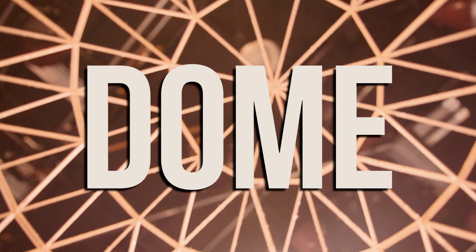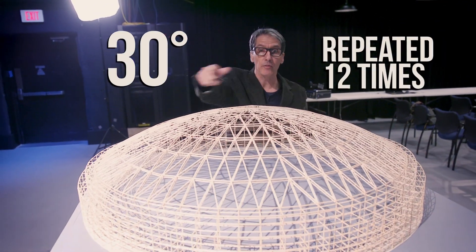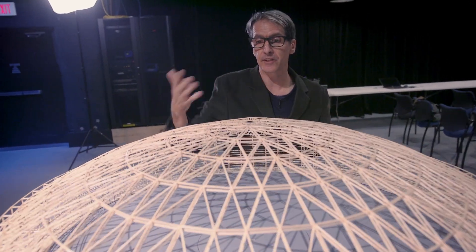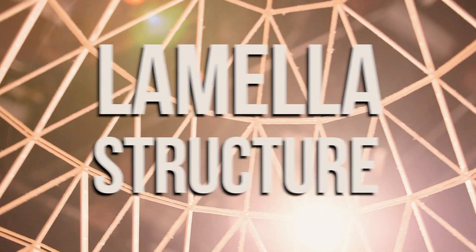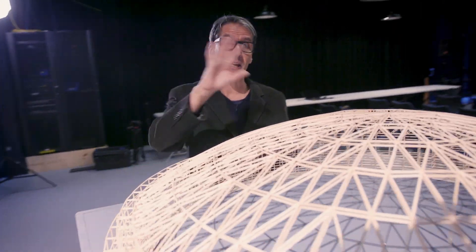The dome structure is very different — that's the second aspect. It's composed of this 30-degree segment repeated 12 times around the center of the dome, made up of triangles. It's actually called the lamella structure. Lamella structures are famous for making things extremely thin while spanning huge distances.